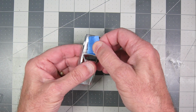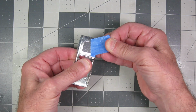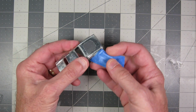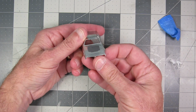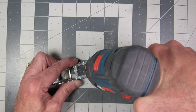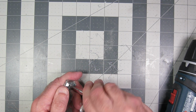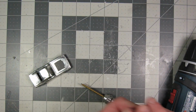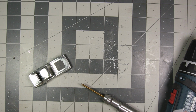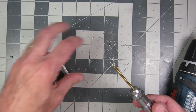And so as you'll see here, when the tape comes off, you get a really nice surface. Not to say it's not going to need spot putty or anything like that, but if you pack it in there right using the toothpicks to make sure it gets in all the corners and you spread it out evenly, it works out really well. So once I realized I succeeded at that part, I drilled it and tapped it so I could put it back together later. It has two posts, using 2-56 screws. Pretty typical for virtually all of my builds.